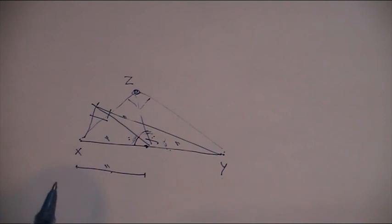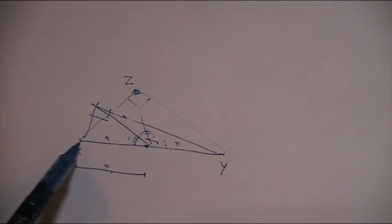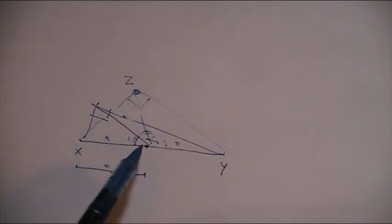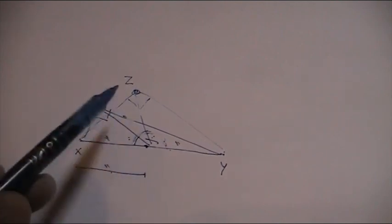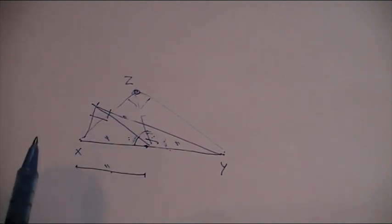And so that's really all I wanted to say. I wanted to share that with you. It saves making a 3-4-5 triangle on site. You have just the requirement for a piece of wood or metal or any other material with an angle here of equal length. So good to go.